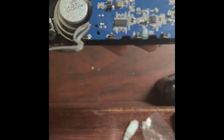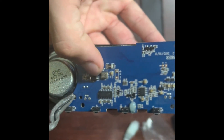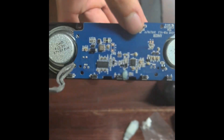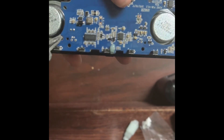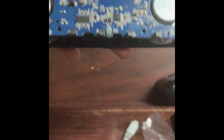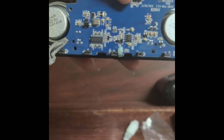It's amazing what you can get out of an amplifier that size — SMD components are incredible for how much power you can squeeze out of them. We have a diode here, probably amplifier-related, and even an inductor. The Bluetooth chip probably has a DAC — digital-to-analog converter — built into it and feeds a direct audio signal out.